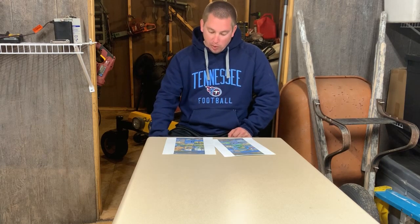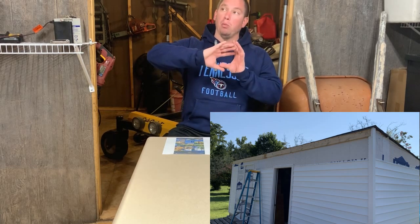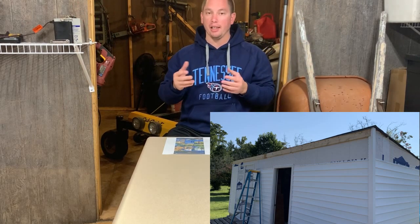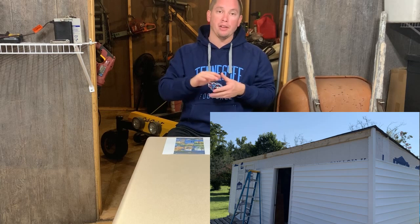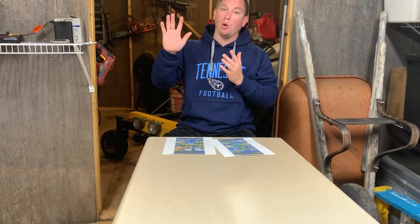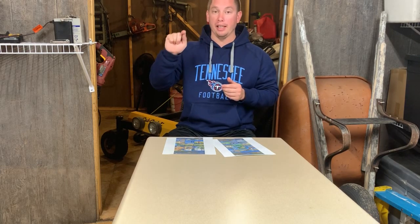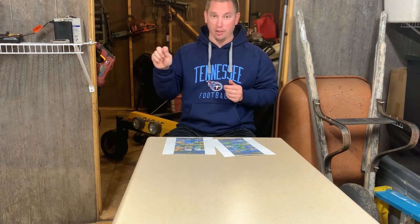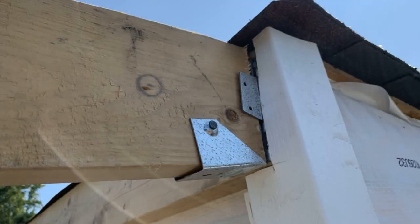Once I got to that point, I moved on to the other side of the overhang, which is up against the shed. I put a board all the way across the front of the shed. I was in the middle of putting the vinyl siding on and I stopped before I got up there so I could work my siding around that. I figured out where my studs and roof rafters were on the shed, and made sure to nail this board into the roof rafters. Then I'm going to put the rafters up against that board and they're going to sit on the beam on the other side.